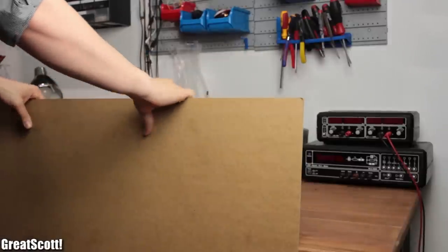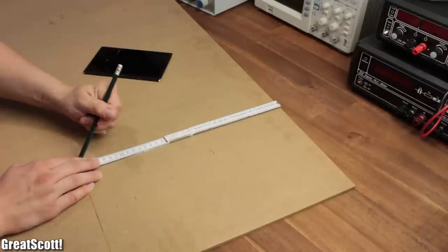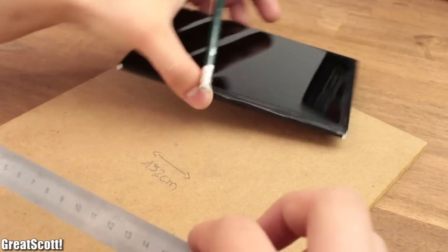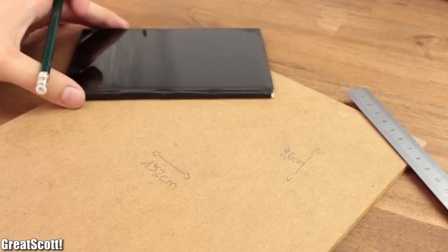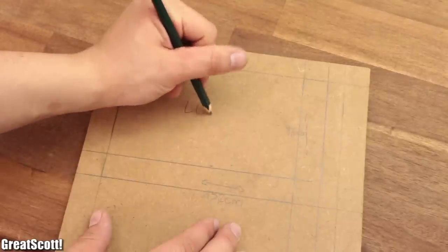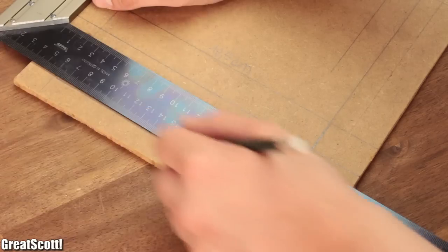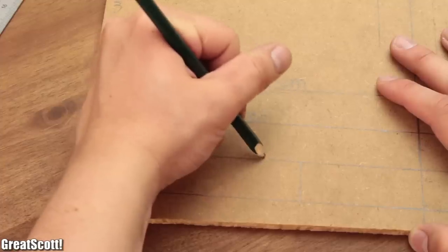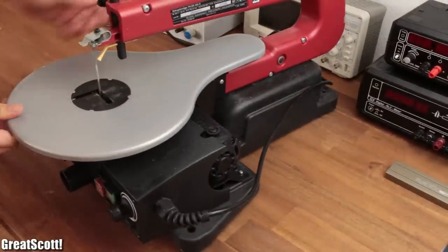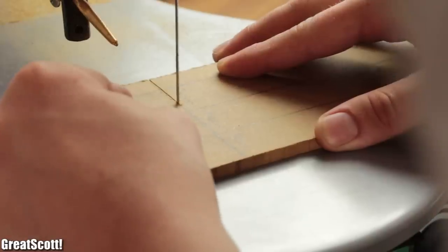Time to build the case. I started with a 1m by 1m piece of 6mm thick MDF and did some basic measurements of how much material I would need. I used a wood saw to cut out my desired piece and measured the width and height of the visible screen of the LCD — the useless plastic around it does not count. I marked spots 2cm from the edge of the board and used them as a reference to draw the visible LCD screen onto the wood. I used my scroll saw to cut out the pieces — MDF is a soft material which makes cutting very easy.